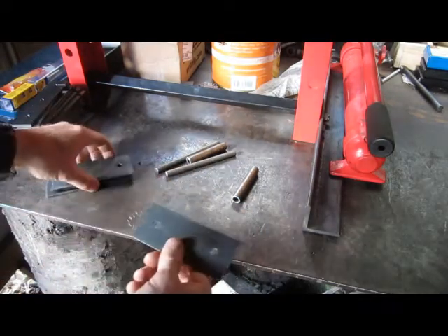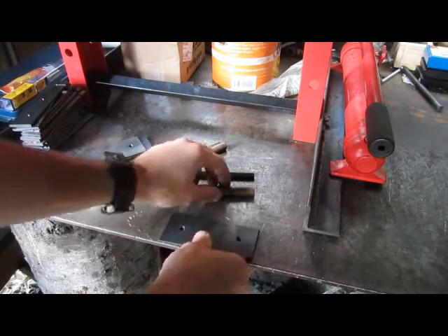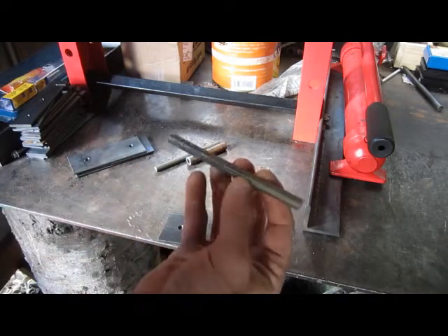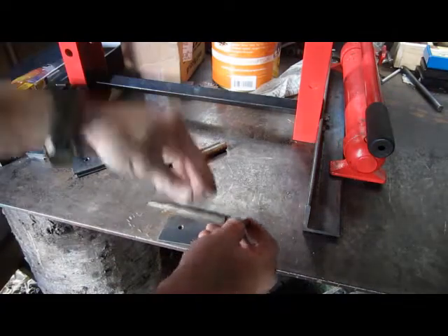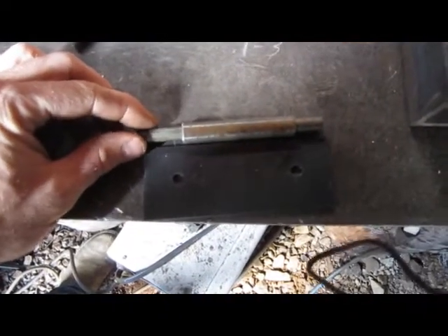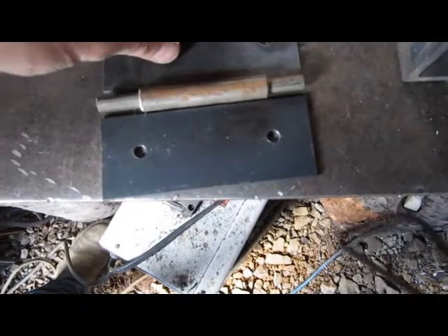Now for the hinge, what I did was I got four plates here, drilled holes in them. And then what I'll do is - this is a piece of pipe, just a piece of three-eighths, standard steel round stock. And stick that through. I'll take and put that up against like such, and I will weld this piece to this piece here - the round stock. I'll weld that to this. And then I'll take my other piece, bring that in at the back, and I'll weld that to this part. And that'll create my hinge.